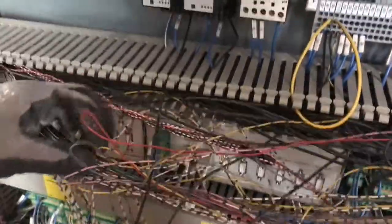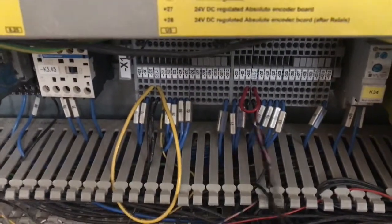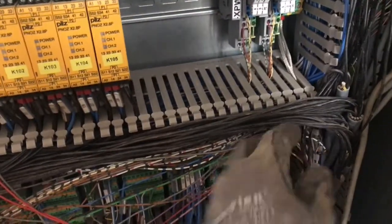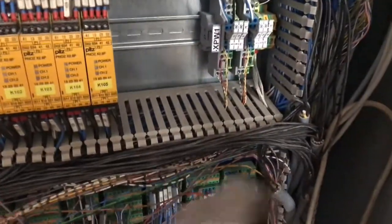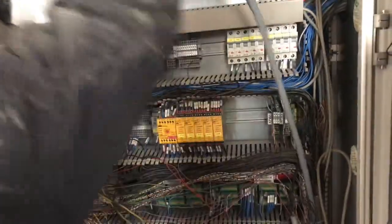You'll see that all these wires inside the cable are landed in different spots in the circuit cabinet. For example, this one lands on a relay. It lands at this SLS terminal right here, and it lands at this SLS terminal here. All of the wires that come out of this cable are already landed in the spots where they need to go, so you don't need to do anything else to land your new cables. All you have to do is pull this cable out of the bottom of the circuit cabinet a ways and cut it off back about six or eight feet from where it lands.